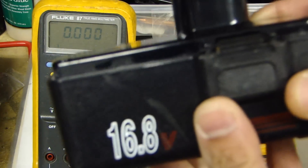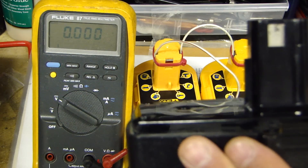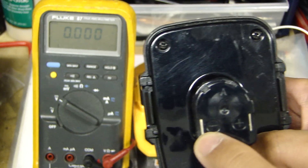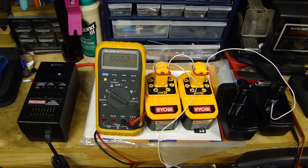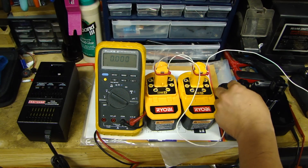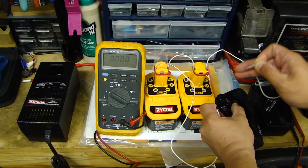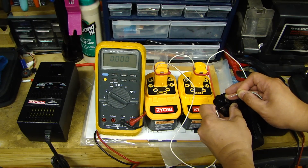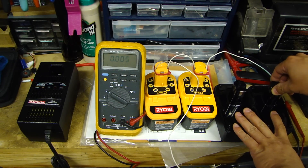To jumpstart these batteries I let them drain and die to zero volts. I pulled these out this morning after sitting on the shelf for a couple of years. On the top of the battery terminal you have the positive and the negative terminal. The procedure is: the negative terminal of your power source connects to the negative of your NICAD battery, and then on the positive terminal you quickly hold it really tightly so you don't drop it and zap the positive contact — it will give you a spark. I'm not going to do it on this battery because I already tried it a couple of hours ago and these are fully charged now.